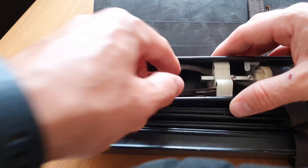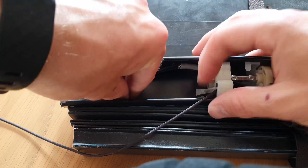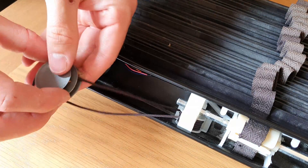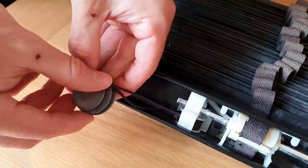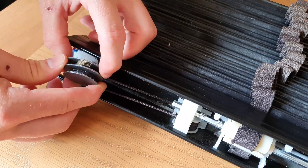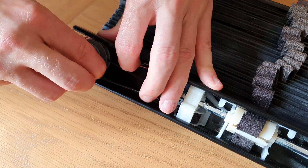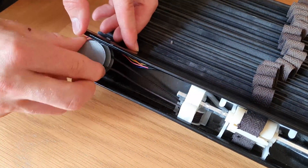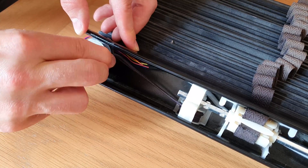Next it's time to attach the spooler to the motor, but before doing this pull one end of the cord to one side to create one long end and one short end. Take the longest end of the cord and thread it through one of the holes, tie a knot in the end, and then wind the rest of the cord around the spooler. Finally take the shortest end and thread it through the remaining hole, tie a knot, and cut off any excess — it should be long enough to reach the motor but not too long. This may take some trial and error. You can then attach the spooler onto the shaft and test the mechanism — turning the stepper one way turns the shaft one way and reversing the direction turns it the other way.